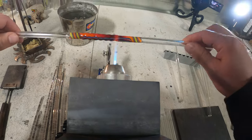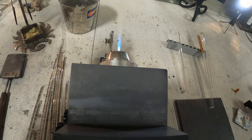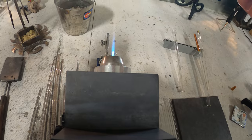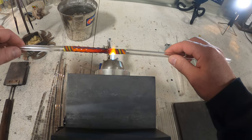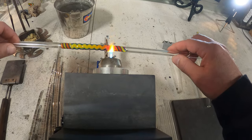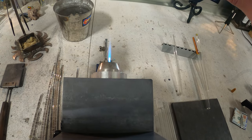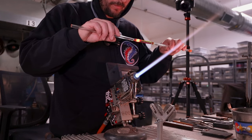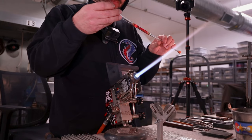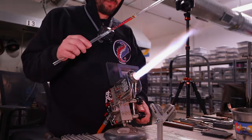Here I sped the end of this up. It's about consistency — I noticed when editing that each heat took about 10 seconds and each time I pulled it out and looked at it took about five. So there is a rhythm and a time. A good rule of thumb is you never want to change your flame unless you have to. Ideally you're going to set this flame and not touch it while you're putting the kicks in, then jump back up to that bigger flame to do the termination.